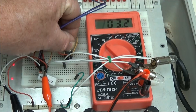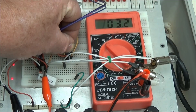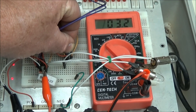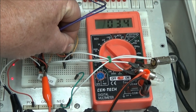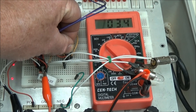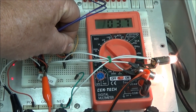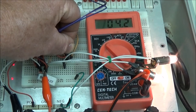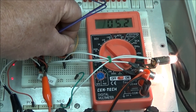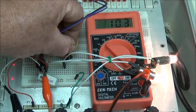The first problem people will run into is they're running Raspberry Pis or Arduinos at 3.3 volts. I haven't found a MOSFET yet that will work properly at 3.3 volts — you'll have to go up to 5 or boost the voltage somehow. You can see the light bulb coming on at 3.7 volts, and by the time I hit 4.2 it's switched all the way on. By the time I get up to 5, it's on plenty well, and I can go all the way up to 12, fully switched on hard.